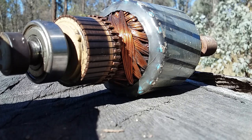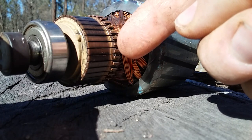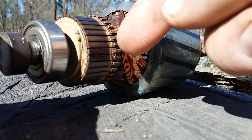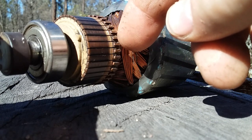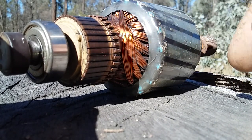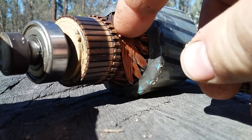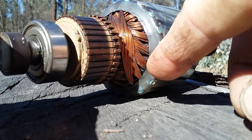As one big coil, if you were to draw a circuit and have a coil centre-tapped the same number of times as the commutator segments, you'll find that as the segments are connected to power via the carbon brushes, each one of these coils — there's a coil there, there's a coil there, and these are looped right round the rotor — the impedance of the coils means that two of these coils at any one time are powered.